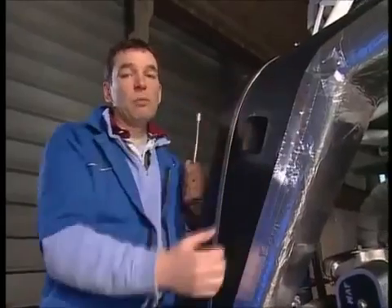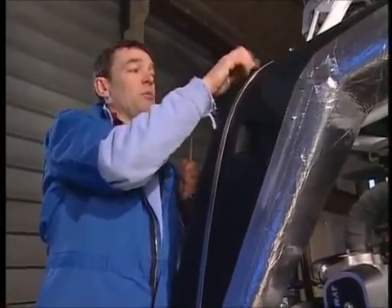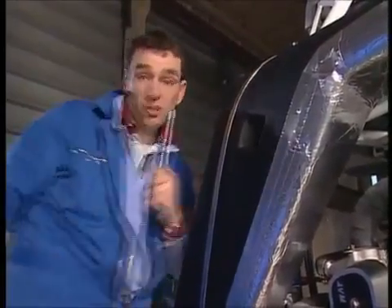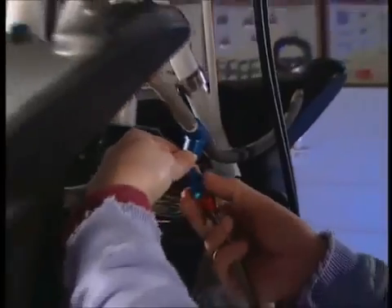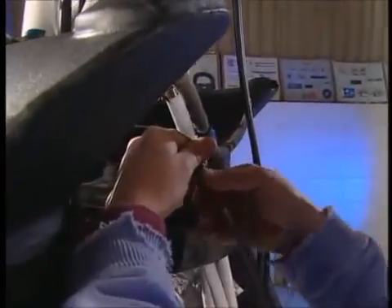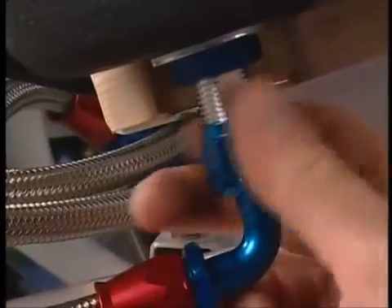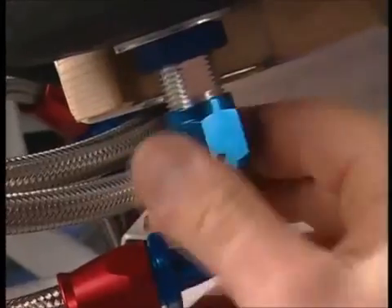The straps themselves will all be sprayed up and then some rubber put underneath them. There's a fuel filler gauge in here to go in, but that has to be calibrated — we do that later on. There are two connections left. One is the fuel return from the regulator, like so. And the last one down here is the outlet to the cut-off valve. And then that's it — it's pretty much connected up. Obviously there's a little bit more work to do on the fuel system, including taking all these pipes off the tanks again so we can finish the straps. But it's a good job.